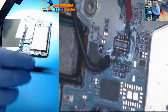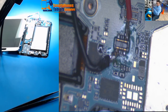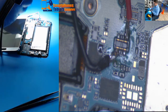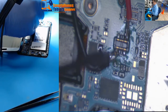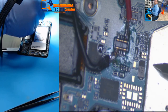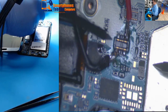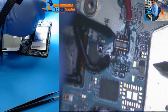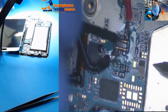It's easy to know what is negative. You just have to put the multimeter on continuity. The only thing you have to do is put the multimeter on continuity, and then if I touch this — now I know that's ground. So in this case, this line is ground and this is positive.